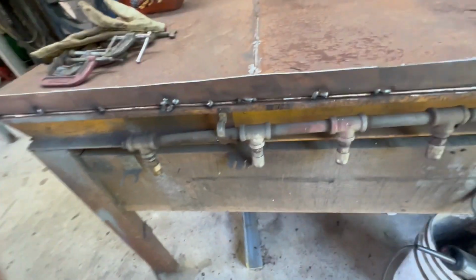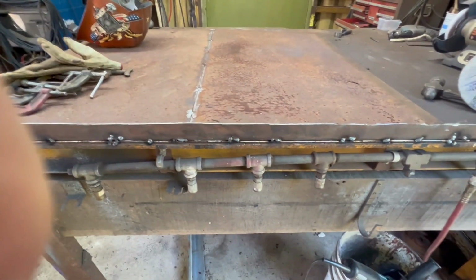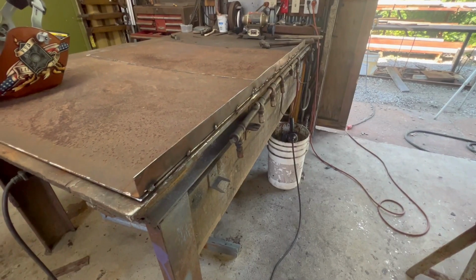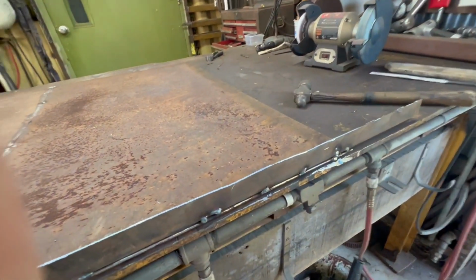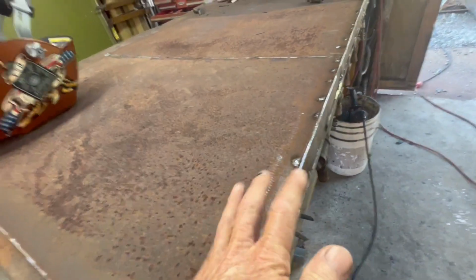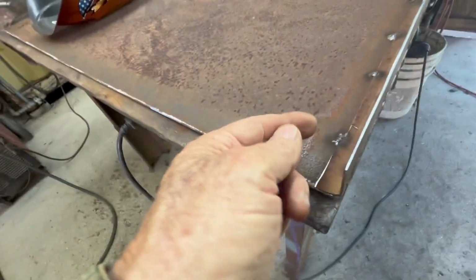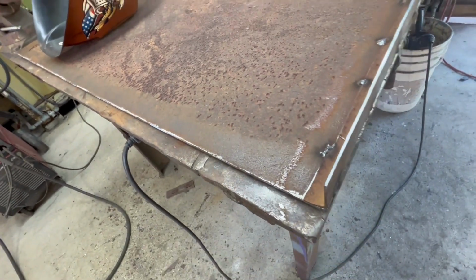But anyway, if I cut this loose and cut this loose, hopefully it'll stay put and not bow up. Clamps are off, and I cut the two welds where I had welded it to the table, and it stayed pretty dead gum straight. I'm pretty happy with that. I'm gonna rotate it 90 degrees, fit the next angle to this angle, and do the same thing.